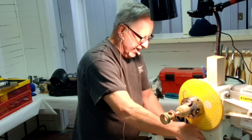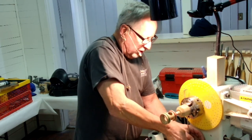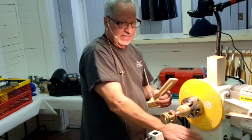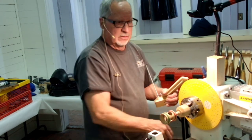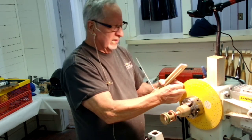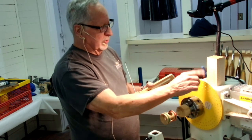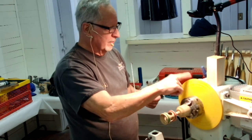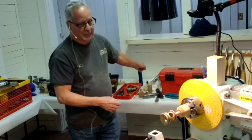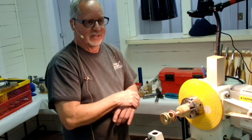The other index wheel I have is the Alisam index wheel. It comes with a really, really nice index pin system. It's magnetic. It sits on here, magnetized to the bed. So you can actually pull it out of the hole and let it drop back in, or it has a spring-loaded plunger that'll pull out and lock back in. It's nice. It has more accurate holes than this and more holes than this one. The one that I really like, and I still use that pin with it a lot of times. That's the reason I made it cone-shaped, is it'll fit any size hole up to 3/32.